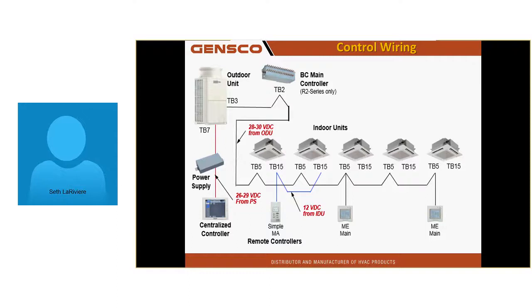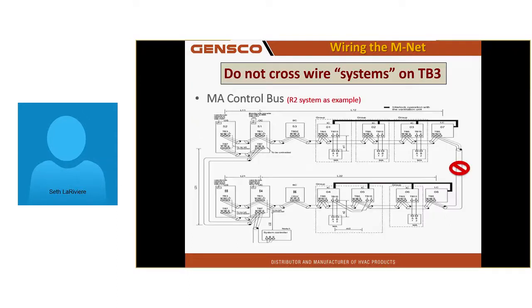If you run into that after the fact, that weird things are happening to the thermostat, it can do weird things. And the flaw is that I can go into group settings and set every other group in that building to that stat, give it a set point, and then unset them from that stat. They're trying to get away from using that stat in hotels now.